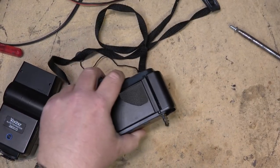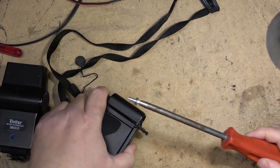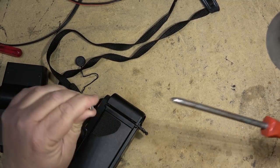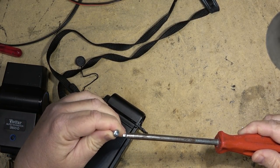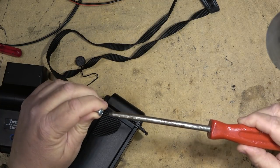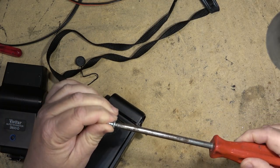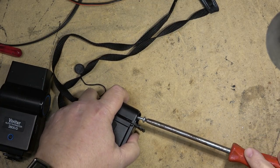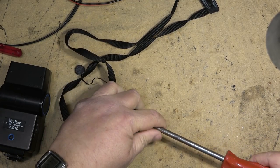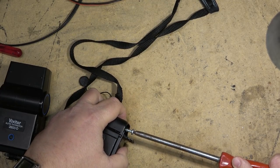Now, one of the ways that I used to get batteries out in the past was I drilled them out. The easiest way to do it is to use a screw, and I always recommend something that binds to the bit and locks on the bit, like a real Robertson with a real Robertson screwdriver, because that screw has positive torque to the screwdriver, and then we can generally drive the screw into the bottom of the battery, and hopefully it will go through.